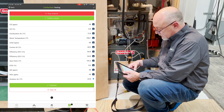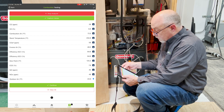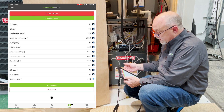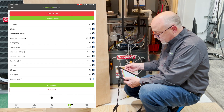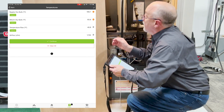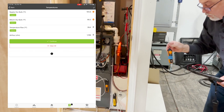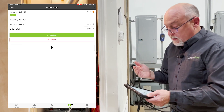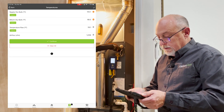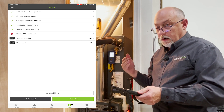You can also see we're doing NO and NOx along with our outdoor air temperature. The way to tell when this is stabilized is you look at your CO — our CO is stable, our O2 is stable. Our stack temperature will continue to rise very slowly because the return air temperature is going up, but as long as it's not rising quickly you can see it's rising by tenths. Everything on the furnace is now nice and stable. I'm going to hit continue and pull in my temperature measurements. I have my supply air and return air, measured here with a Testo 115i and a Testo 905i — both are supported. MeasureQuick is doing the temperature calculation. We're doing 1,200 CFM of airflow on this furnace; for a 60,000 BTU furnace, that's pretty high airflow. We're at a 39-degree rise, so all that looks good.